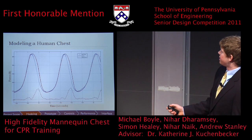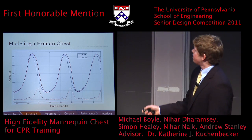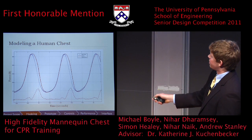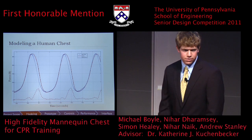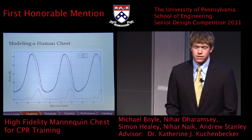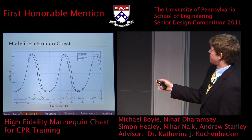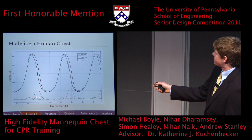The red line here, by plugging that spring force deflection curve into the displacement data, you can see that it follows pretty linearly on the increasing force during the compression, but on the decreasing force during the rebound, there's a pretty large amount of error, which we have mapped out as that vertical displacement as the force error on the lower curve. So what we wanted in our model was to include that damping force on the rebound. We did a least squares fit over all 60 compressions worth of the data, and you can see that by including this damping force on the rebound, the data fits much better, and the force error is well below the 50 to 60 newtons shown here, closer to 10 or so.